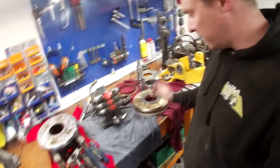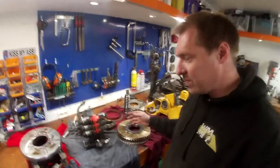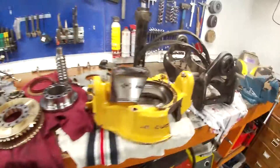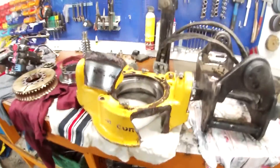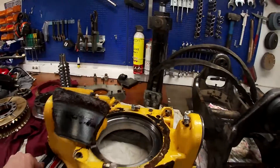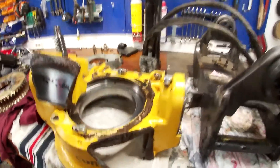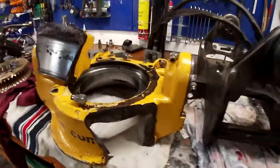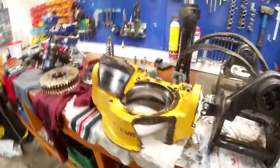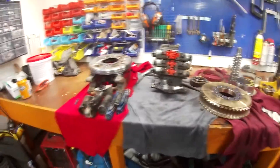Everything is cleaned off - I've degreased it, removed all the old grease, and coated everything in a thin layer of oil so nothing will corrode while we're waiting for the cast iron welding rods to arrive. You can see it's pretty thick so I need to grind a V-shape to fill with weld. I'll probably need to preheat it, cool it really slowly, knock it with a hammer after welding, and can only weld one centimeter at a time. The next part will be welding and grinding - remember to subscribe so you won't miss it!